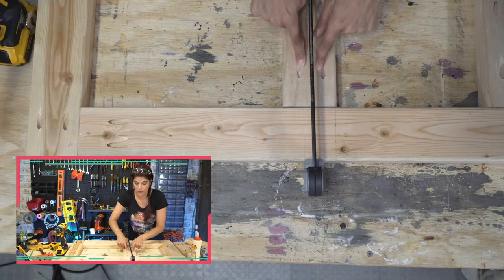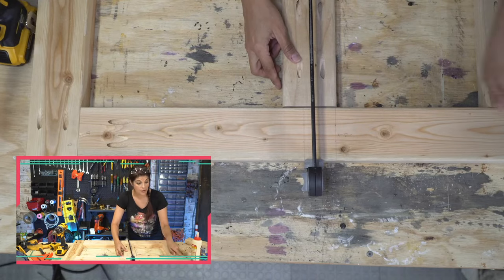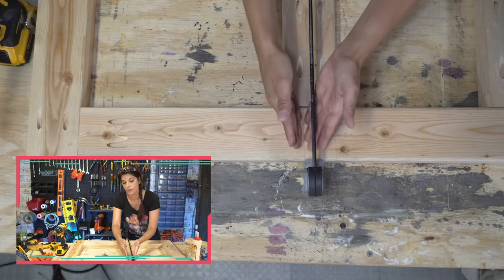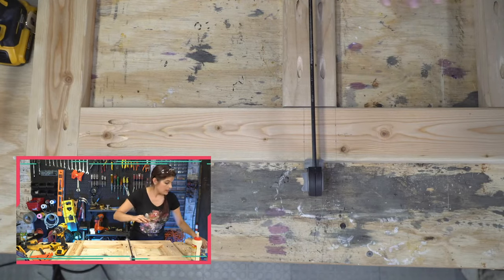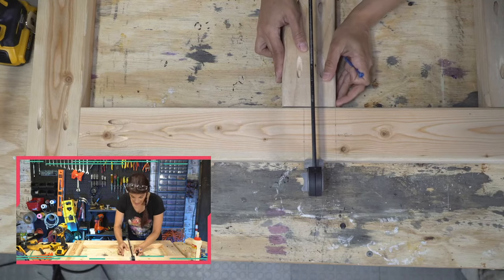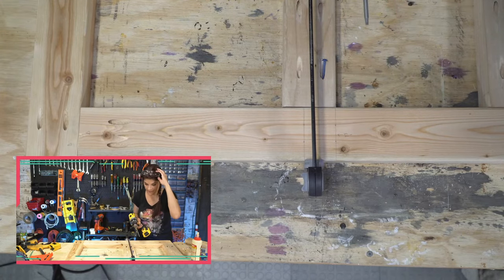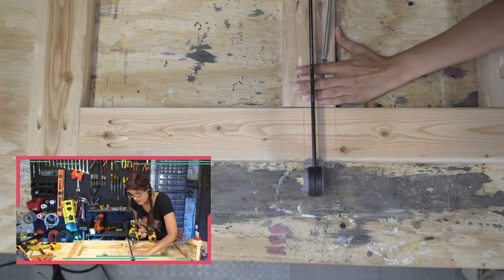I have my two pocket holes, which screw into here. Here I measured 13 inches from the bottom. So all this up to here is 13 inches. And then this is 15 inches. This is just to help me put where the support beams are going to go. So I tried to put these marks on beforehand, so I had it in mind before, instead of trying to wing it too much with you guys. Now, I like to wing things, but sometimes I try and aim for some degree of accuracy.